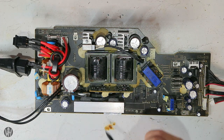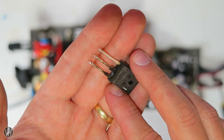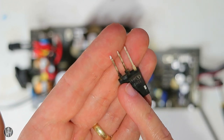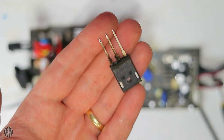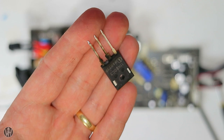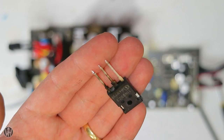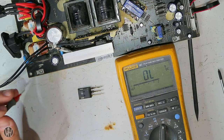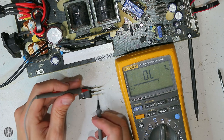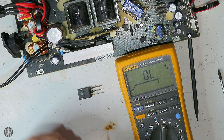Let's check some parts in this section. What I didn't see before — not only the capacitors were bad, but also this MOSFET. There is clearly an overshoot that happened and this part is probably a short circuit. Before I proceed, I need to get the correct type of MOSFET and also the right capacitors. After that, it should work. Let's check the part — I've put it in diode mode. The component is clearly damaged, so I need a replacement.